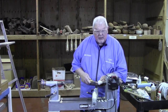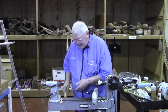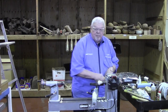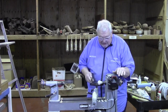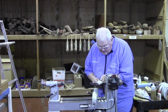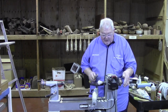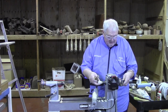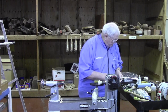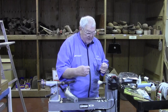That tool doesn't make the groove very well — what tool did we use to groove? Seems to me like that's the skew chisel — I better get it back out. Hadn't planned on doing this, so I might as well. Skew chisel standing on edge. Three small lines. The rattling is this knob that's loose down here — let me make that go away. Now I'll take my burning wire. The tool rest is out of the way. The burning wire does have handles — that helps.